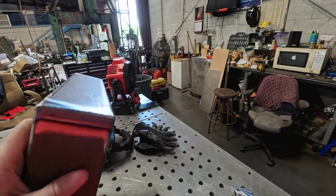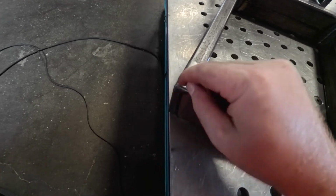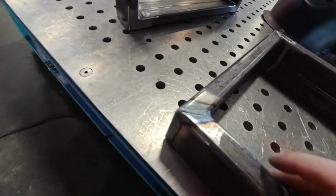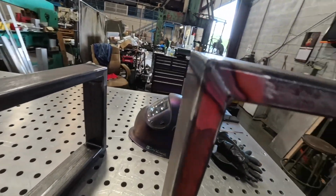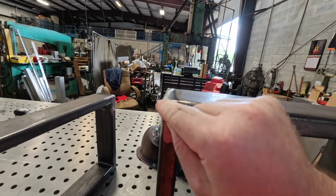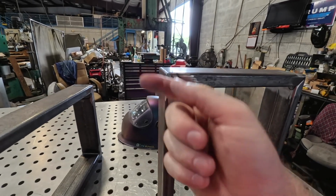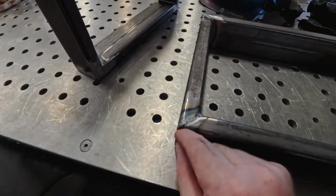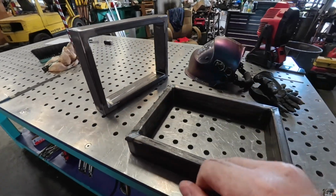One more tip when you're welding: say I'm welding this weld right here and I'm ending right there. If you end too hot and you don't taper down or move over when you're ending that arc, especially if it's scratch start, you'll get a little dot, a little crater hole. I filled them up on this, and I make sure I don't do that. If you leave that crater and go to grind it down, you'll have that crater hole in there, and it's going to go all the way through most of the time. The only way to get rid of that is to weld it back up, or taper down like that. Sometimes I'll end the arc, have that little crater, and you can just fuse right over top, or add a dab of wire if you want. That's one thing to keep a lookout for, because otherwise you'll be back and forth to the welder and grinder. That happened to me a lot at first, something I learned.